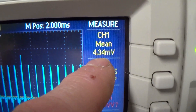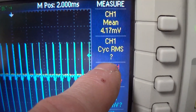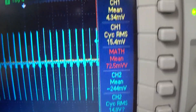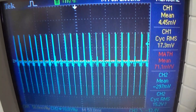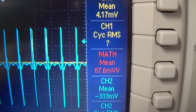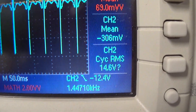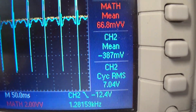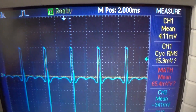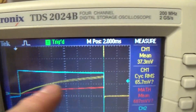Around 4.27 millivolts - and that would be our RMS value. It's fluctuating a bit; I'm not sure if maybe I have too many samples. Let me expand back out a little to see if that stabilizes it more - it doesn't change anything. There is the math, and there are the voltage RMS and mean values - basically 20 volts. There were 10 volt divisions and you could clearly see exactly two divisions, so that's what's important to look at.